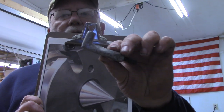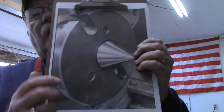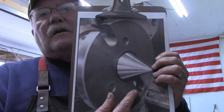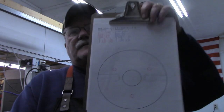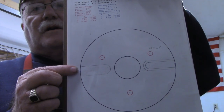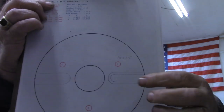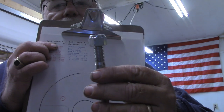Now for some of the smaller ones, that dog tail will not be long enough to reach into this slot. So down at the bottom there'll be another slot milled in there to hold a bolt. What we're going to attempt to do today is make something like this — about this size — but one side will have a straight slot for the long tails; the bigger dogs will reach that. Over on this side, we'll have a two-step in there for the head of a bolt to fit in there.